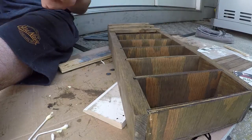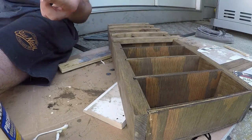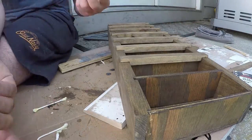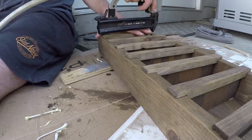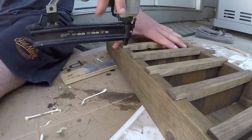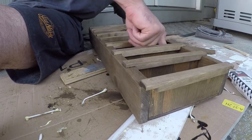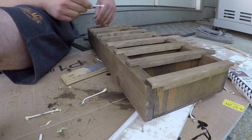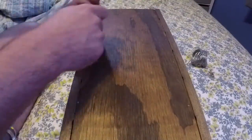Finally, I'm placing the front trim pieces on top. I put them all on first, then came back with the nail gun after. I didn't want too many nail holes on the front since those are visible, so I only did one nail hole per side per board — nice and clean, keep it centered, take your time. After a final glue wipe, we're ready to hang everything up.